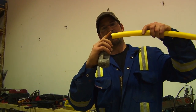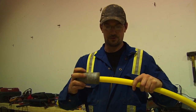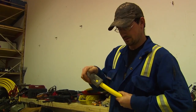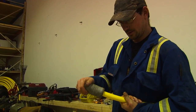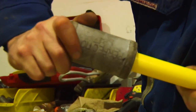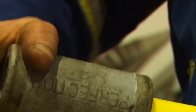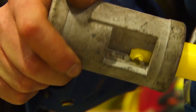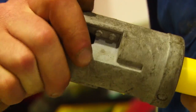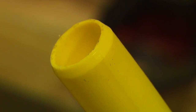The whole point of the chamfering tool is to bevel the outside edge of the pipe. Once your pipe is clean, you stick it inside the tool and give it a twist. It slowly chamfers the pipe — you want to make sure you do a few passes to ensure it's square all the way around. As you can see, it ends up tapered.